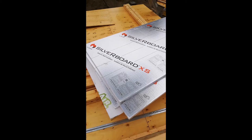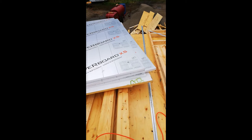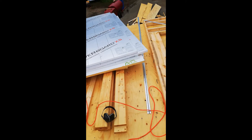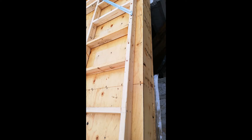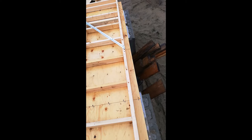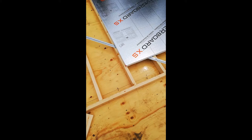Now I'm fastening the exterior sheathing — inch-and-a-half insulation board. Some people put all the walls up first and then add sheathing, but that requires ladders and scaffolding. This way I can put the insulation board on while the wall is flat, then tip it up. The board is 8 feet, but my walls are taller due to the rim joist. I measure: 9.5 inches plus 1.5 is 11 inches, plus three-quarter-inch plywood is about 11 and three-quarter inches overhang needed past the bottom plate.